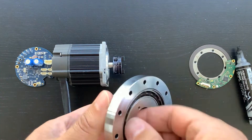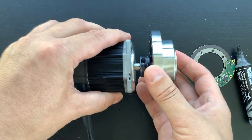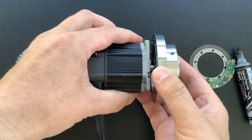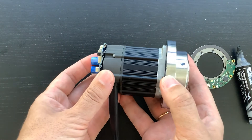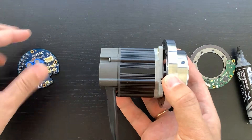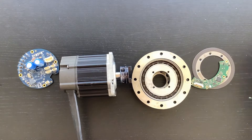In contemporary servo designs, a frameless torque motor is typically used. The electric motor's output shaft should be mechanically linked to the wave generator of the harmonic speed reducer. Servosila brushless motor controllers are used to drive the electric motor. Upon receiving a command from a control computer, the controller first moves the drive's output shaft to a specific commanded angle, and then holds the position under the influence of external forces that try to disturb the balance.